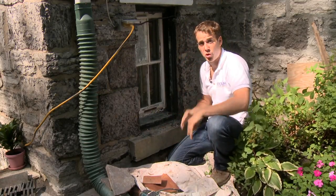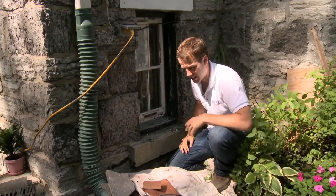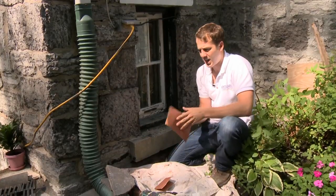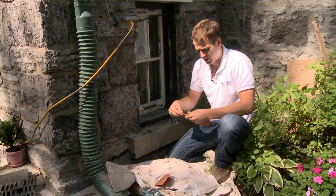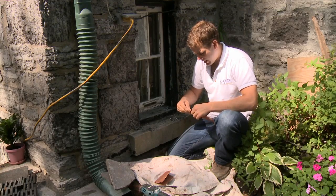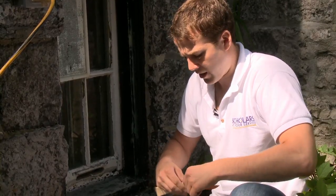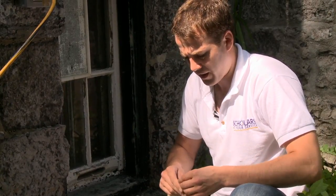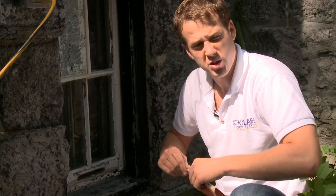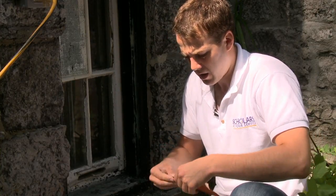This window sill is getting good. I'll get my vacuum shortly and vacuum up all these chips so that the client is satisfied with the cleanliness on the job site. Now, the second way to do sanding — and what I really recommend because we guarantee this on all sites — is to use our electric sanding equipment. This is also going to leave a finer finish and allow you to sand down some of those edges a lot smoother than hand sanding.